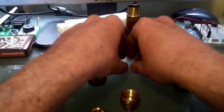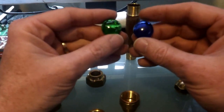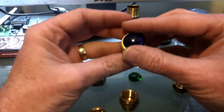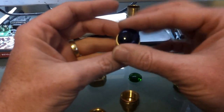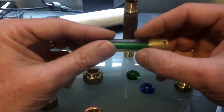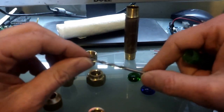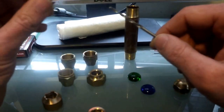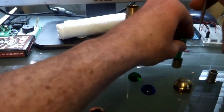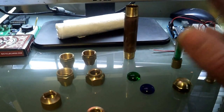And that's roughly the body parts. There's the glass beads I've been using for the emitter — you can buy a bag of these for two bucks. I just pick the roundest ones, then take the emitter and sand out the threads until the bead fits into it, and put a bead of glue around it before you set it in. The other thing is the acrylic rod, which I get from Amazon and have to drill out the center. A cool thing I found is this Dremel multi-use drill bit — it's not as aggressive as a regular drill bit and it kind of leaves more of a flush hole, which makes the wire a lot more visible through the acrylic.